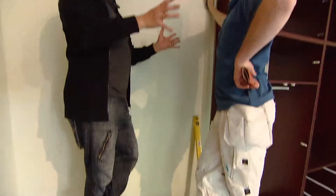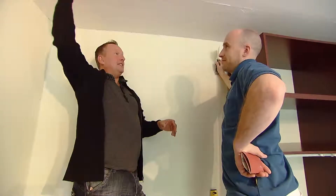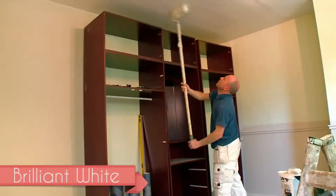Eddie, the bedroom is the one room where you're lying there looking up, and the ceiling needs to be perfect. In this case, if you've got huge cracks all over it, something needs to be done. First, Neville, I'm going to scrape it, second sand it, third fill it, fourth sand it again, and then fifth paint it.